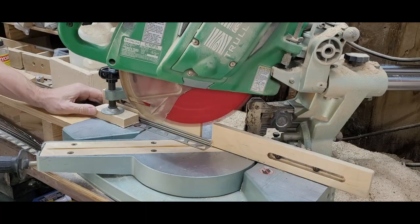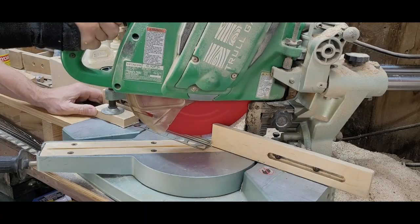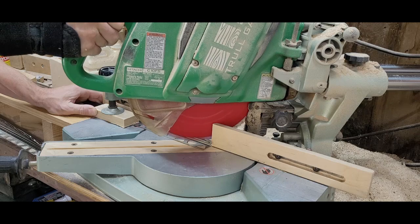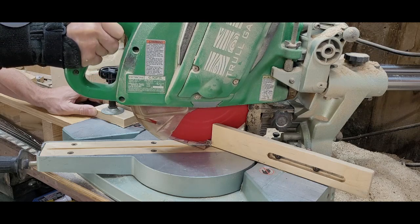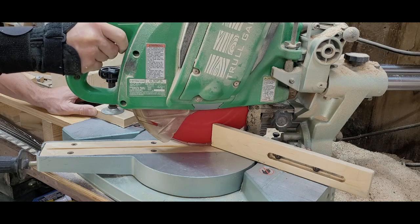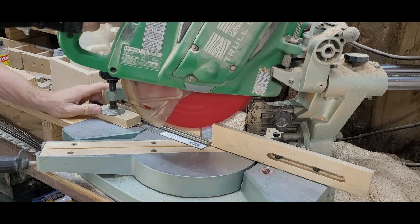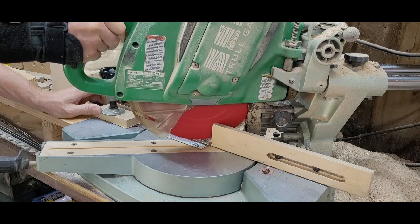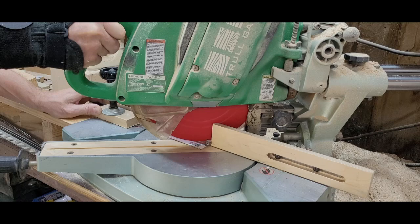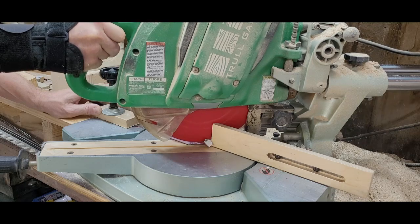Next, I went over to my miter saw to cut 4 pieces of aluminum tile edge, or Schluter strips. I use that to surround the tile on the substrate. This is thin aluminum extrusion and can easily be cut with standard woodworking tools. Just go slowly. I made a 45-degree miter cut on each of the 4 pieces, clamping each piece down for the cut.